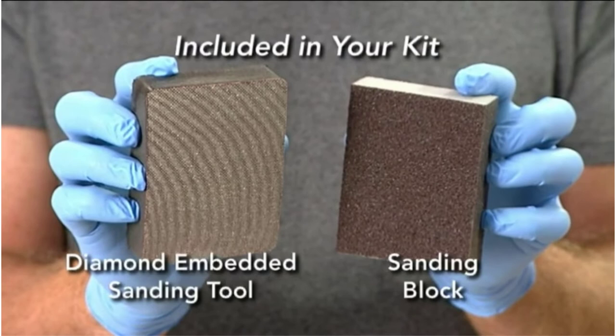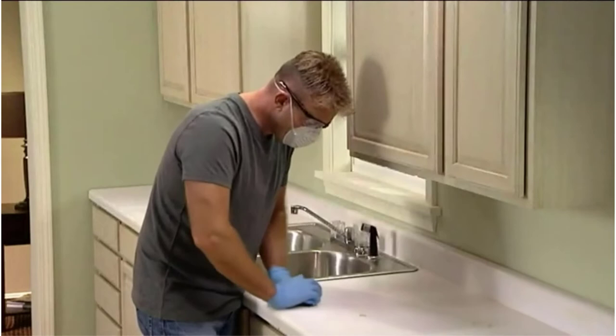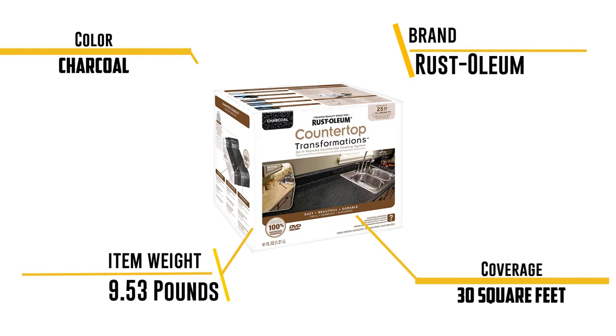This paint is warm safe rather than heat safe, so you need to be mindful when placing hot items on the kitchen surface. While it cures to be food safe, it is only intended for brief contact to avoid cross-contamination. The two-part epoxy resin top coat seals the paint effect beneath and dries to a hard layer to protect the surface for years to come.